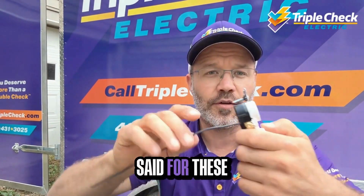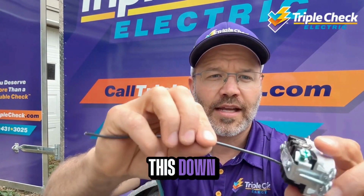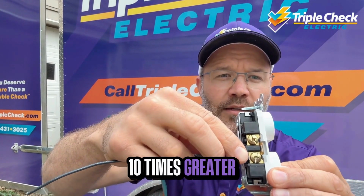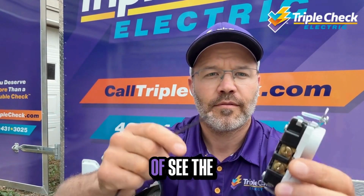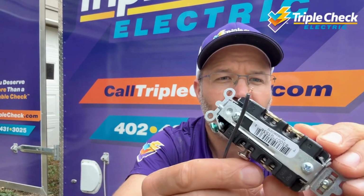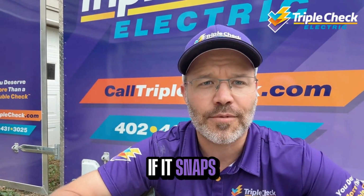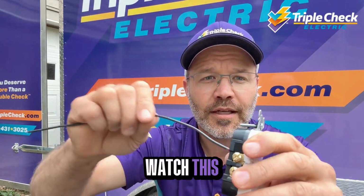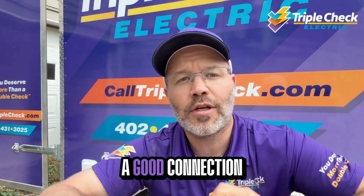Same can be said for the pressure plate style. When I tighten this down, I have a surface area that's about 10 times greater than backstabbing. See, the wire just snapped. It's still in there. That's the only way this is coming out, is if it snaps. Whereas with the backstabbing, watch this. Here it comes. It's off. This is not a good connection.